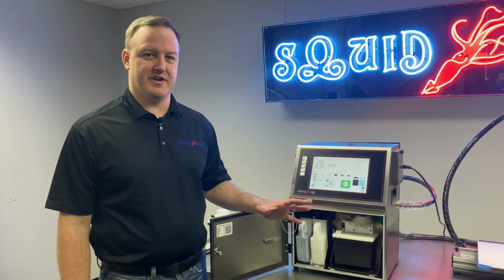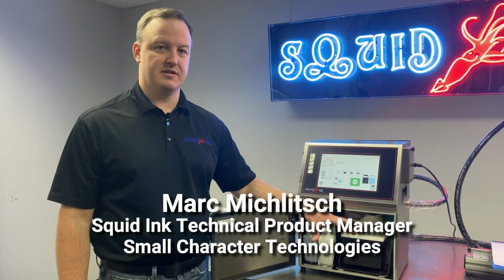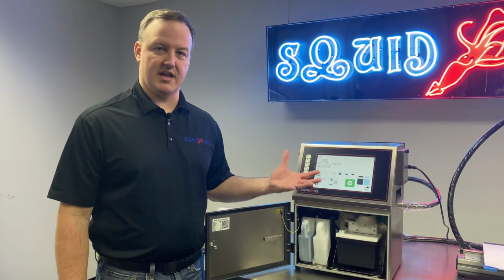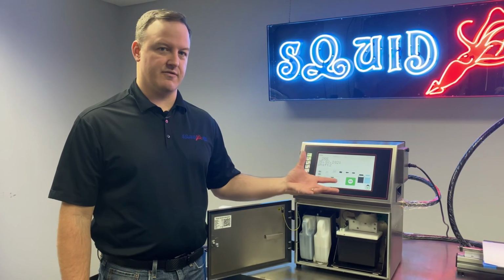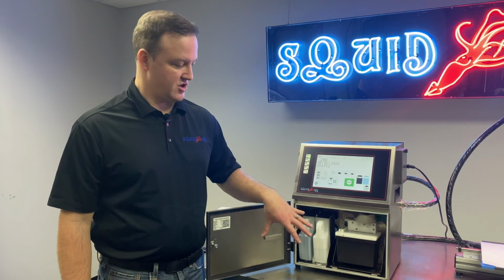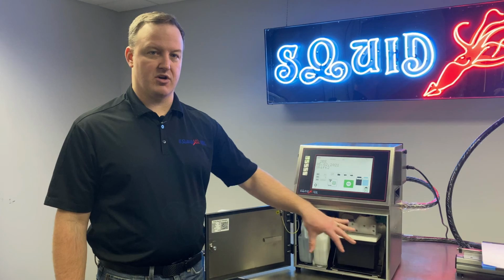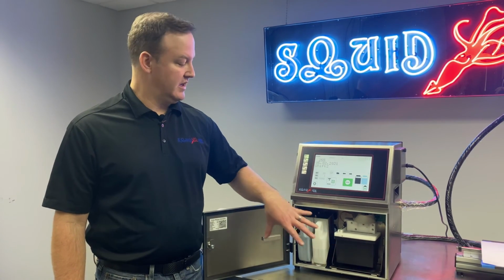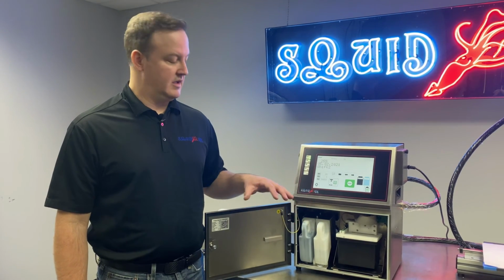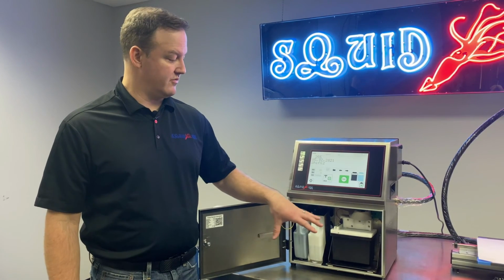All right, hopefully this video has helped explain the operational theory of the level detection part of the mixed tank assembly, how it should be calibrated as far as the motherboard is concerned and that reference voltage, and how this works. If you're not sure how getting fluid to the tank is happening or how that works, or if you're having problems with that, make sure you view our video regarding troubleshooting adding ink and makeup to the mixed tank. That's also an important part of how all of this works.